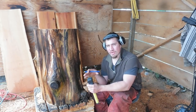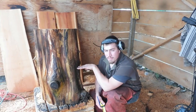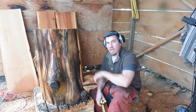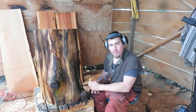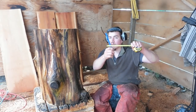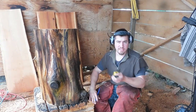Scratch that — you're gonna want to mark 15 because my log's a little bit short. When I say you're cutting in about a foot, if your log is short, don't cut it so you only have an inch on the back end. Leave a lot of meat on there. I'm gonna do the back cut in one go. What you're gonna want to do is have your seat, and then you want your back to have a slight angle — the key is where you start up top, you end four inches down below on your seat.